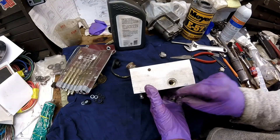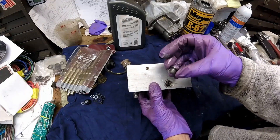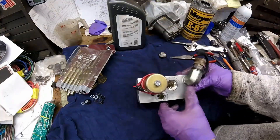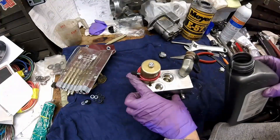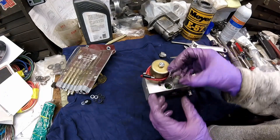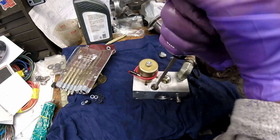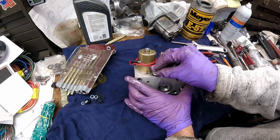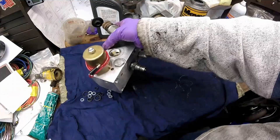In this bottom valve portion, it gets a ball bearing, gets the thick short spring, and then the Allen bolt with a new O-ring. On the opposite side of that bottom one, it gets this valve, and you put the smaller end in first. First I like to put a little oil in there and oil on the valve. Put the smaller end in first. Once that's in I like to get a screwdriver and make sure that it's moving like it's supposed to move — and it is. Now I put the upper bolt in, and it's got a new O-ring. Next on this block gets the hose connection with a new O-ring.